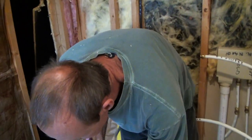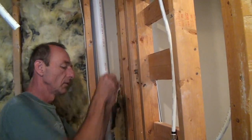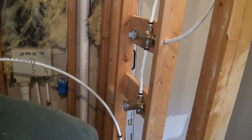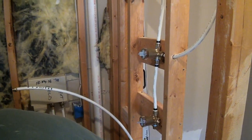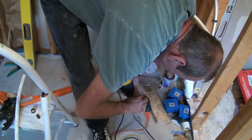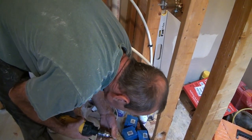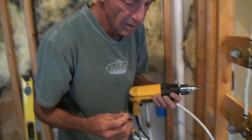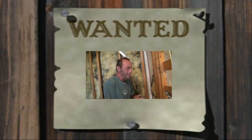Seriously, that's no exaggeration. To sweat pipes with a torch and solder, cleaning your copper pipes, using your rosin paper, getting the burrs off your copper, cutting the copper with the little cutting tool, and then torching and solder and everything else you got to do. It takes a long time to do it the old-fashioned way, which was all copper fittings, torch and solder. PEX has replaced all that craziness, really, with a better product, an all-around better product. Oh yeah, and cheaper and better.